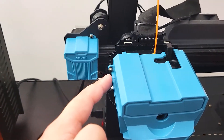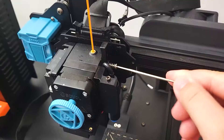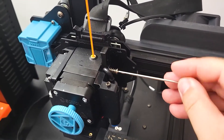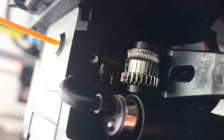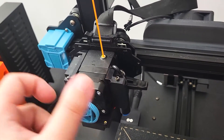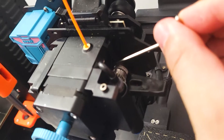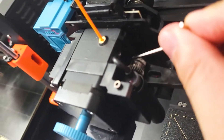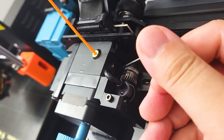There's also an easy way to do a quick inspection through the filament tensioner. All you need to do is fully loosen the filament tensioner so you can see the spur gear in there. If you can't see the spur gear, just rotate the extruder knob until you see it. Carefully put the allen wrench in and try to turn the set screw clockwise to see if it is fully tightened, but I still suggest a full disassembly and inspection.